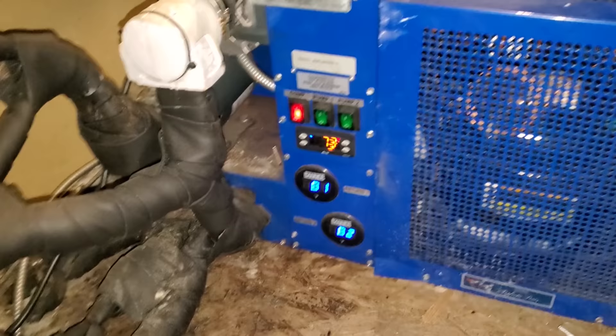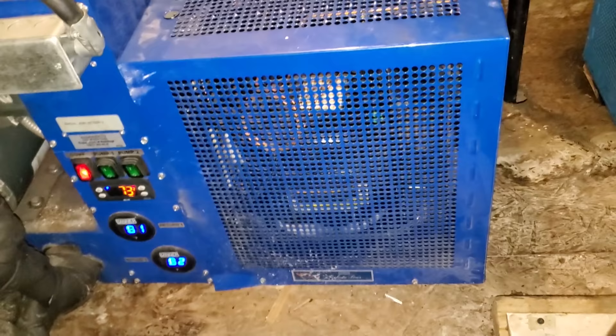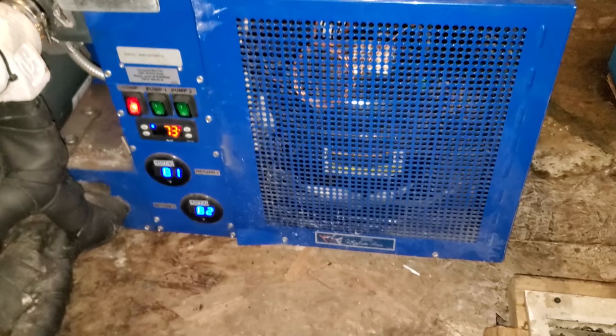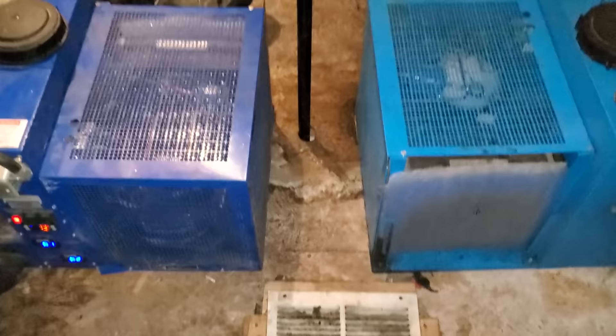I shut off all the pumps right now. Well, look at this guy — he's still running. That's weird. I wonder if these things are off on high pressure. Let's get the covers pulled off. When I came up here, this was open into the attic and it shouldn't have been. Maybe it just overheated up here. No — because there's frost, so it's not off on high pressure.